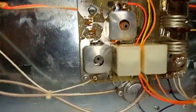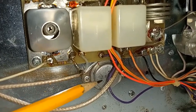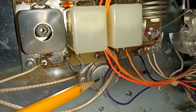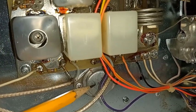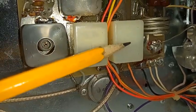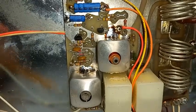This is the underside of the BC-2000. I want to start by showing you this TO-3 case transistor — this is the voltage regulator that provides the 5-volt supply to the very power-hungry TTL circuitry I was talking about. These are the engagement and disengagement relays for the receiver preamp and all the adjoining circuitry here.